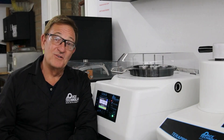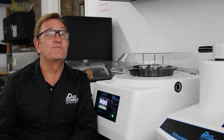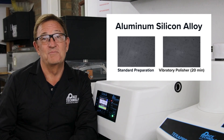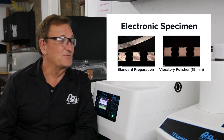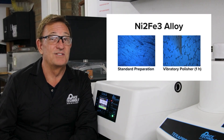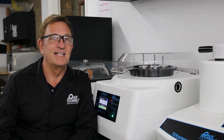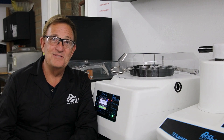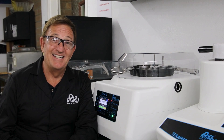To summarize: the vibratory polisher is extremely useful for the ultimate surface finish. You can also add etchants to the polishing compound to achieve an etch-polish, which can produce a really nice etch on your sample while also removing subsurface damage — useful for any kind of subsurface analysis. The vibratory polisher is an excellent tool for many labs, so get your vibe on and get a vibratory polisher.